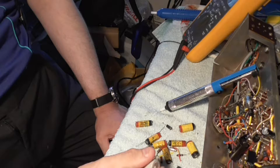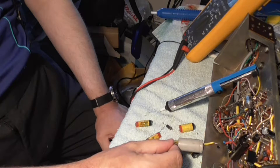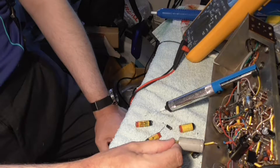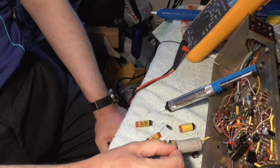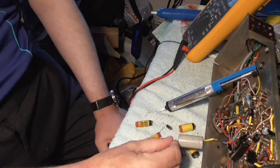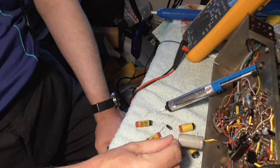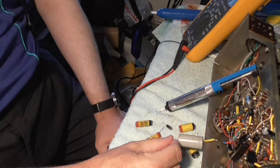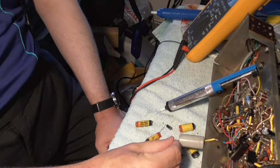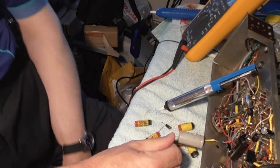I am going to remove all of them. The trouble is the capacitors I am replacing with — even though they are the correct value — are so small that I have to extend the wires, and you can't see what the value on them is anyway. With my eyes, wearing glasses and stuff, I can't see what the values of these are. So if anybody wanted to come in here and look at this, they are going to have to get the schematic to find out what the capacitors are, because there is no information on them.